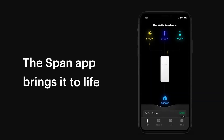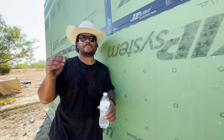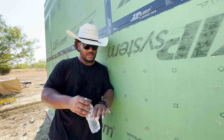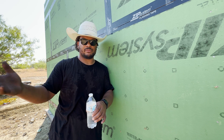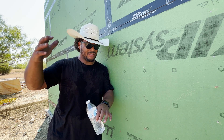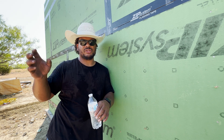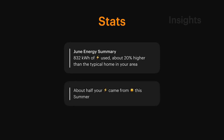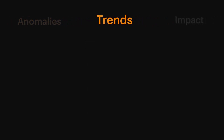That's what we're running in this house. The reason we're doing that is because this is a new build — we don't know how much electricity we use. When you're shopping for solar systems, you have to understand how much power your house draws so you can get a properly sized solar system. You don't want to overkill it with excess power, but you don't want to undershoot it and not have power over the winter months. Here in Texas, the worst months would be December, January, and maybe February. The Span panel lets us look at all the data and calculate exactly what solar system we need.